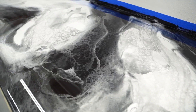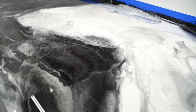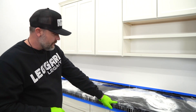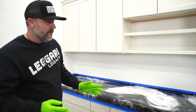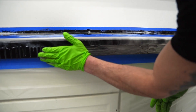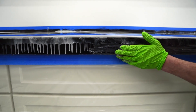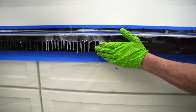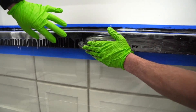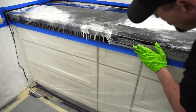We're going to show you how to create these natural, beautiful edges — it's that time. We pull that weather stripping, let some of that resin flow over just like it is. Then all we have to do is rub in the epoxy, just like Kyle's doing. All he's doing is getting rid of any surface tension, any missed spots where the epoxy isn't over the primer yet. What that allows it to do is flow over naturally and evenly, pulling our design from the top down to the face — creating that beautiful natural edge that you see in real stone.